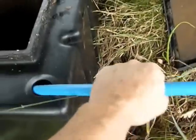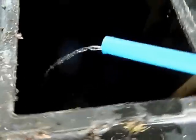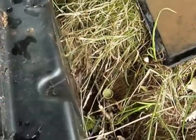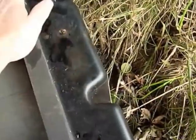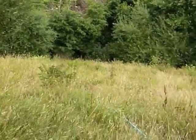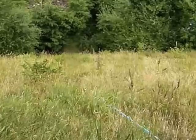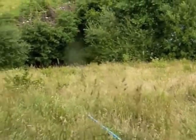Here's the tank at the top of the hill. You can hear it thumping and we've got a wee bit of water coming out. Not a hell of a lot, but this is half full in about a couple of hours - so that's pretty amazing actually. I would say we're at least 20 metres above the ram pump. People say that you can usually pump 10 metres up for every metre drop - 10 to 1. This is double that, and it's not pumping a lot of water, but it is still working. So I'm pretty chuffed about that.